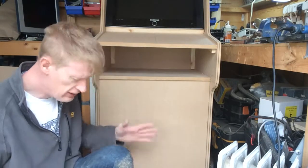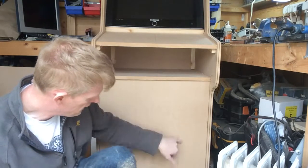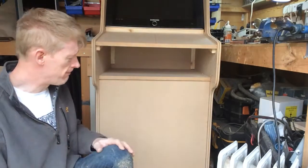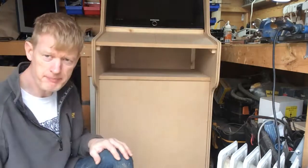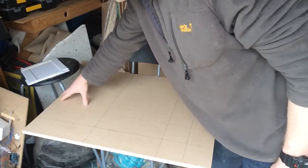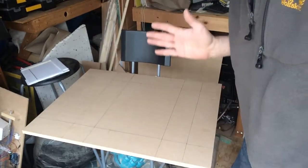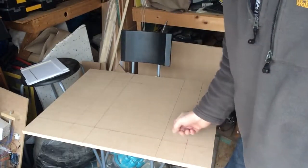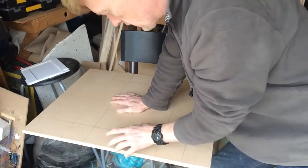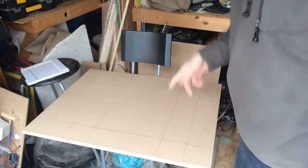So cutting a hole in this — if I cut this, it's going to close up slightly. Somehow I've got to figure out how to cut a hole in here, how big to make it, cut that hole, pinch it, all that sort of thing. And then that'll be the front panel finished, and we can screw that on. This is the front piece — we've come in 100mm from either side, 200mm from the bottom. The speaker goes up here, and this is going to be the door. I changed my mind about some of the distances, there's lots of lines on it. What we'll have to do is saw cut this into four bits — five bits including the door — and then reverse these around so we get a nice straight edge cut on the inside and a nice door. So I'm going to do that and come back in a minute.